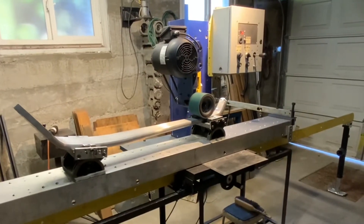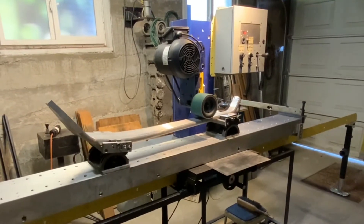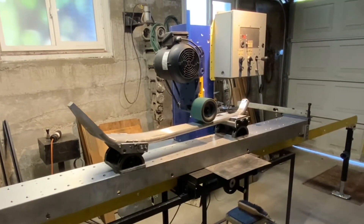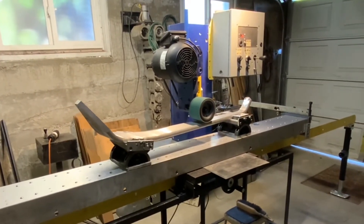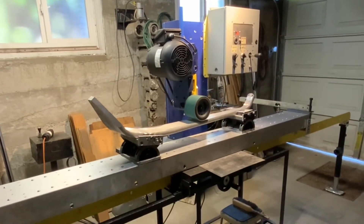The movements of the table and vertical travel are controlled by a joystick, while the cross-feed is controlled by a momentary toggle switch. There is a common set knob for all axes. In addition, there are two rotary pots for speed adjustment. The on-off toggle switch activates the cycle.